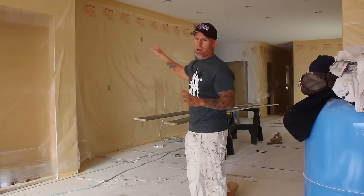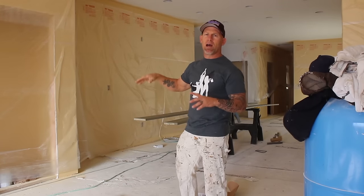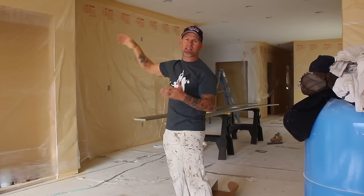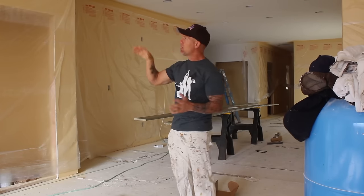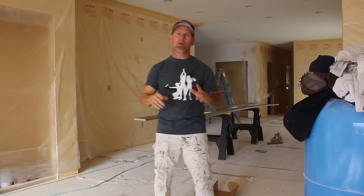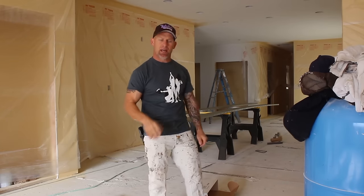You can see around us we're just working our way around this house, dropping our 9x400 plastic — it just comes in a box — and we're tacking it along the ceilings anywhere between 3 and 6 inches from the ceiling. Then our 9-inch paper is going to cover that. We're just quickly tacking it around using ladders with just 1-inch tape.